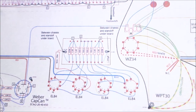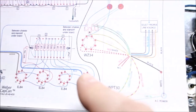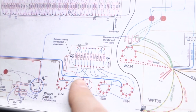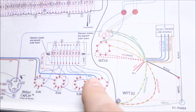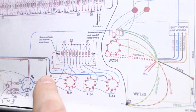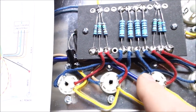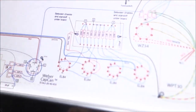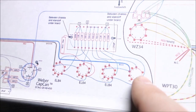Okay, a little bit later in the future, we have wired up the power tubes pretty much according to diagram, but we made a few executive decisions, like earlier, because of the length of the wires of the output transformer, getting to the outside tubes was too difficult. But as you can see, there's a bridge there and there. So I put them on the inside tubes, and the bridges still connect. Second executive-ish decision: all of the cathodes of the tubes tie together.